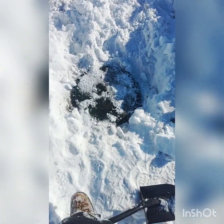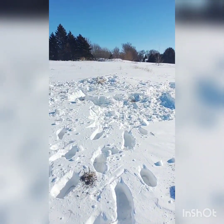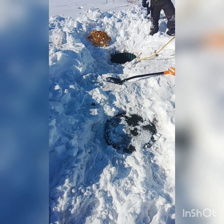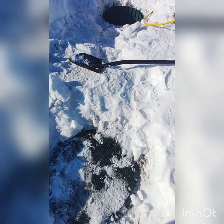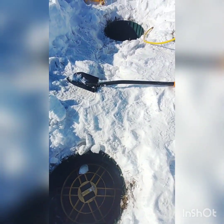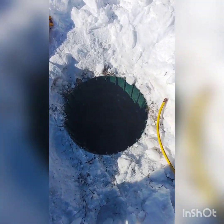Both tanks are uncovered. The line is draining — that's straight out at 90s right here, running about 30 feet to the tanks. We have the camera in the line right now, and the camera is hitting this edge right down there. The line is draining, so the line is clear up to this point going into the first tank, and then the effluent is flowing over into the second tank and flowing out to the leach field.